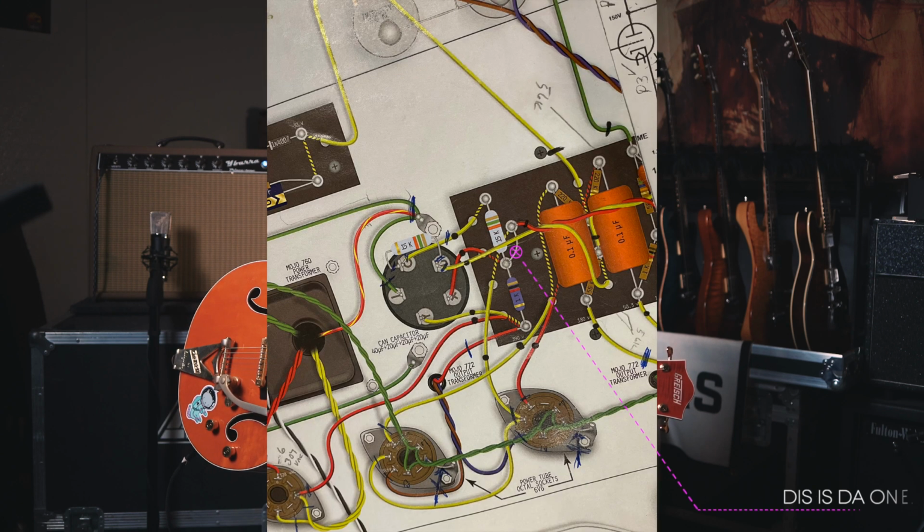It's about this big. And it jumpers one section from the can capacitor to the main board to the next section. That's where that little jumper is. And that jumper is underneath other wires. Maybe we'll send a picture up on this part. And as you can see, it's really easy to miss.